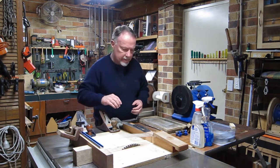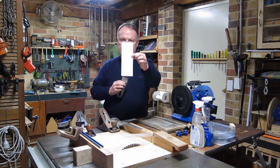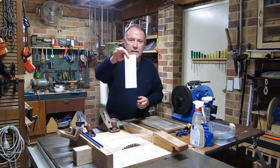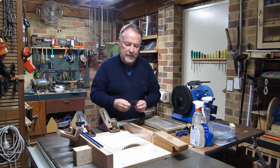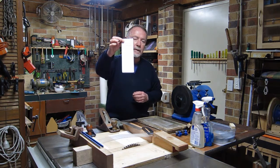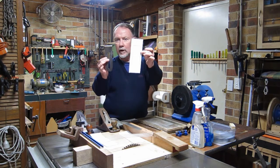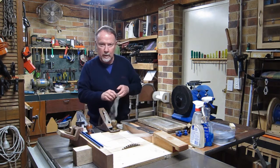The first thing I'll do is take the old plane apart and see what needs to be done. What I expect to find is that the iron will be shaped unevenly. Both of those conditions are exaggerations, but I have had planes arrive like that. What I eventually want to end up with is a hollow grind, so that if you look at the iron from the side it has a concave profile, and if you look at it square on it's 90 degrees to the side. Once you've got that, it should work fine. Let's take this one apart.